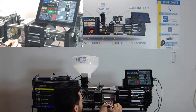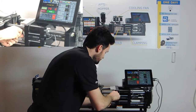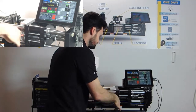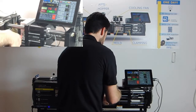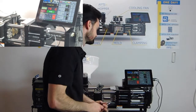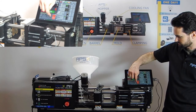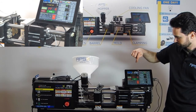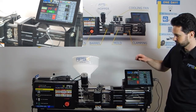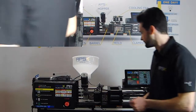Make sure the mold claws go into the groove on the mold, then tighten them in that position. Now with the new mold secured on the right, we can engage the clamp again. Hit halt, and now we'll do the left side mold claws.